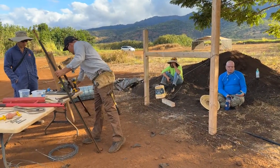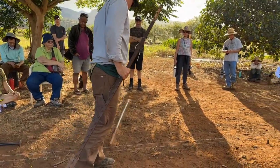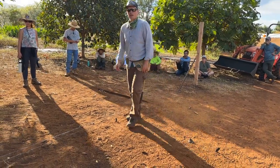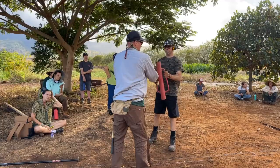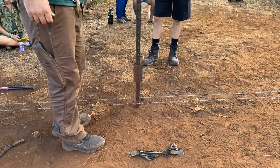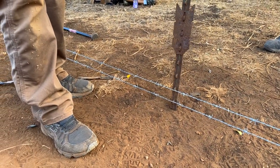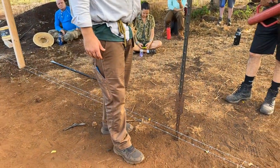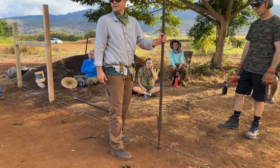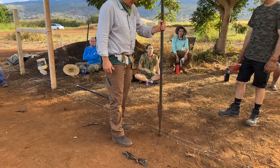I'm a big fan — I just know what my distance is. I usually go one, two, three, and a little step. One, two, three, and a little step, and then they're marked. When you're putting these in, one thing is you want to get it — oftentimes when you're putting your post in, especially where I live, it won't go in straight because there's plenty of rock. Just roll with that and straighten it after you put it in. What's important is that you set it at your line — that's the important part. Set it at that barbed wire and then drive it in.